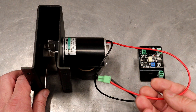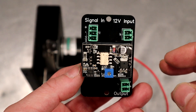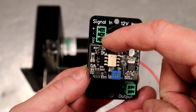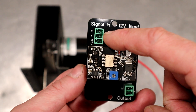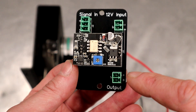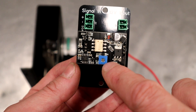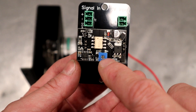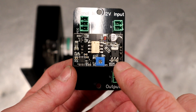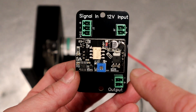This cannot be driven pure off 12 volts — it would go too fast. We want to be able to adjust it to exactly what we like, so there is a board from Cleveland Software as well. We've got our 12-volt positive and negative hooked up on the input side. The signal positive and VCC can simply be 12-volt positive, and then the negative is your signal for turning the shaker on and off. On the output side there's a small Phillips-head pot screw: all the way counterclockwise is zero volts, all the way clockwise is full 12 volts. Mount it near the front of the cab so you can reach in through the coin door and adjust it while the game is running.